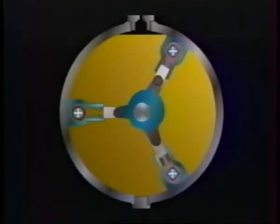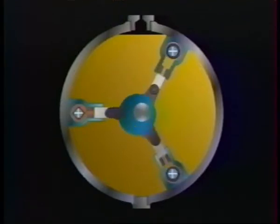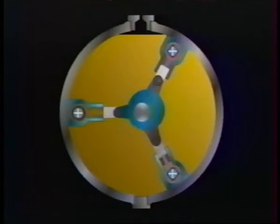The advantages of diaphragm pumps are well known. The separation of all mechanical parts, with the exception of the inlet and discharge valves, from the pumped medium makes them particularly tolerant of fluids which are contaminated or, like water, have poor lubricating qualities.